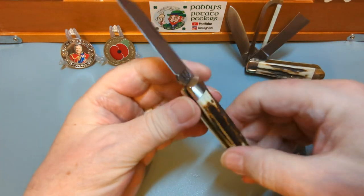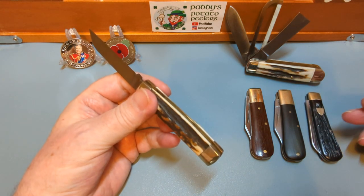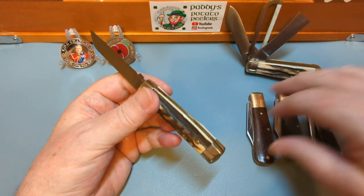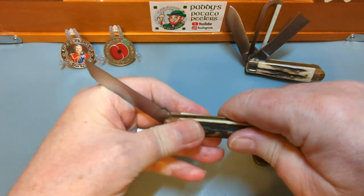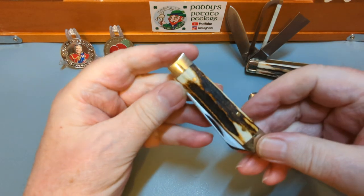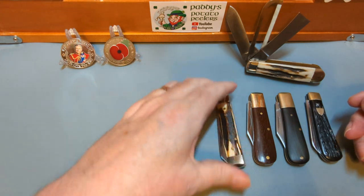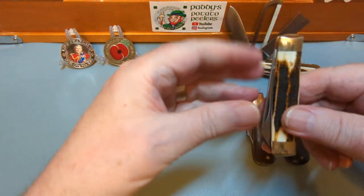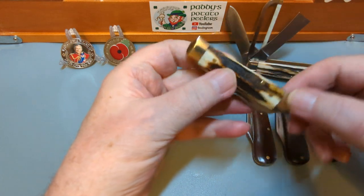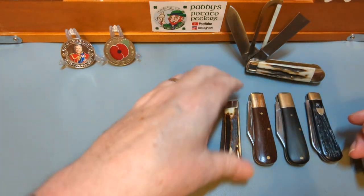Now all Ashley's ones are in O1 tool steel. These older ones would be in C75 or S2, SF200 if they're stainless. This is C75 and all Ashley's are in O1 tool steel unless you ask for anything different. But that is just a beautiful rendition of a lambsfoot — it's a senator pattern. These two square bolsters, slightly upraised — you can see the way it's slightly upraised here — this is their senator pattern.